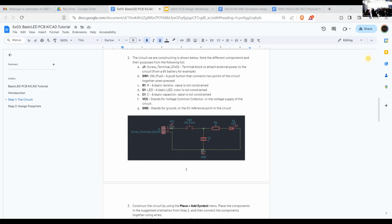If you want to make quantity, you can. I mean, but again, making it from a CNC router is a little bit inaccurate. Like if you don't get the calibration of the machine just right, sometimes you can get unexpected shorts or connections that aren't connected on the PCB. It's a little more difficult if you want to make it yourself. I think with all things in engineering, if you throw money at the problem, it solves itself. It's just the money aspect that we lack most of the time.